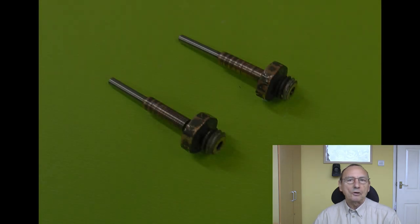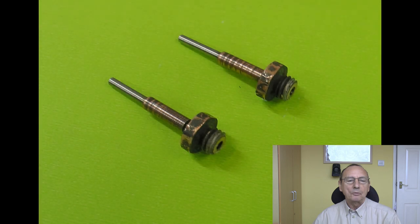So these are the heat breaks that I'm using, and what's inspired me to make this. Basically, I've got a bunch of Slice Engineering Mosquito heat breaks from an earlier attempt at making the mixing hot end, which don't work in that usage case, because with mixing hot ends, some filaments are static as the print progresses. And I found that you get heat creep through the filament itself, which can swell and cause a blockage effectively. It doesn't matter how efficient the heat break is if the heat conducts up through the filament. So it's a problem if you've got